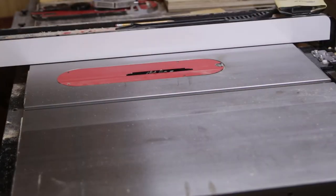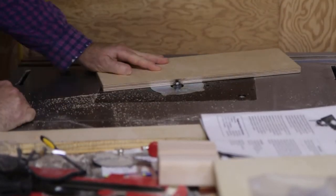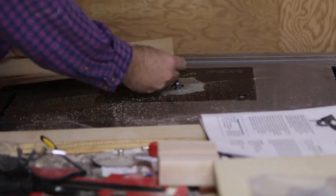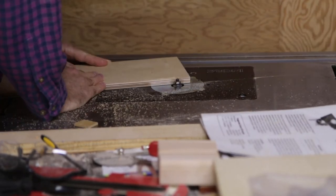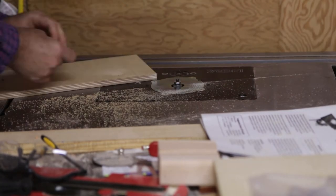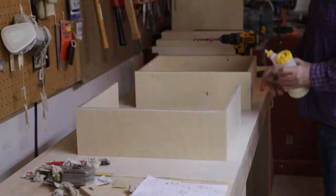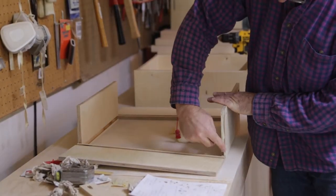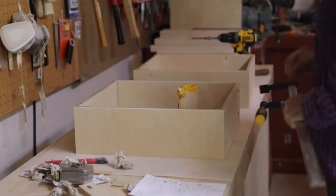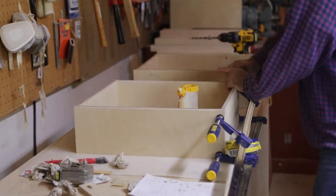This is the sides of the drawers and I'm rounding off the top edges. I'm using the Kreg pocket hole system to hold the drawers together a little bit better — I did glue them too. The drawers have a floating plywood bottom; this is all half-inch Baltic birch.